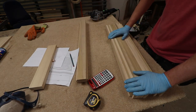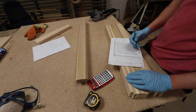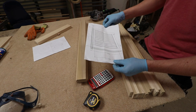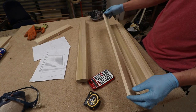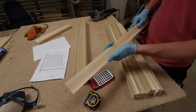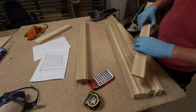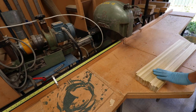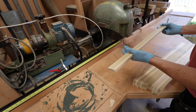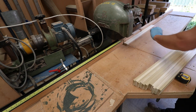Next I'll cut the 12 slats off to the height of this section — between the uprights and the rails — at the same height as the sideboard. That's 690mm from my drawing. I'll set the saw at 690mm and again I'm looking for the nice face to keep upright, so I get a nice clean cut at the end and can domino it without the burrs affecting the domino position. Back on the saw at 690mm. If you've not got one of these, get one — brilliant. Checking for the best face — a bit of damage here, that one to be on the back edge. Square it and move along to the stock and it's done.